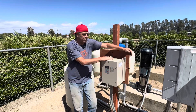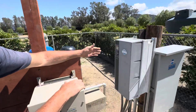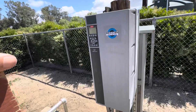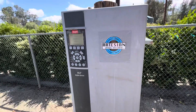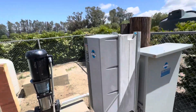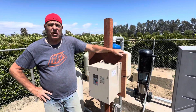It's also a three-phase 240 system. I have a frequency drive for the water well itself which was here when I got here — the Danfoss system is a pretty good system, nothing wrong with that system at all. You can hear the soft start of the booster pump coming up right now and you can hear the RPM start to pick up. That's what I mean by a soft start system.